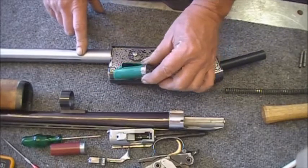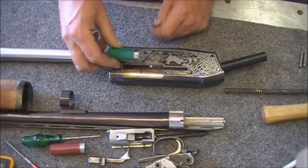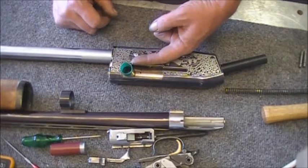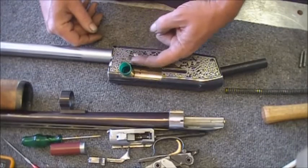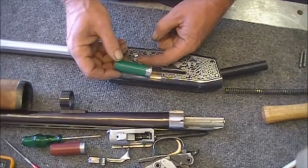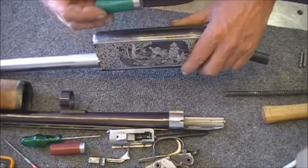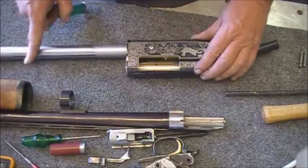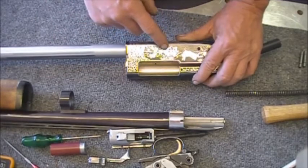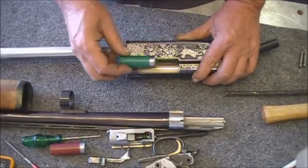Our second step: put a shell in our tube, chamber a shell, and now we're going to find out are we too fast, too slow, whatever. The three options: a sideways shell with a shell sitting underneath it tells us pretty much everything wanted to work — we just didn't get the ejected shell out of the way fast enough. Turn the gun sideways, let gravity help. Shoot two or three and spin it around — if it works great with the gun down, we're not kicking it hard enough, fast enough. Change our ring, slow everything down. The other consideration is the timing of the lift — are we letting that go too early? You just need to look at it and think about how it works.